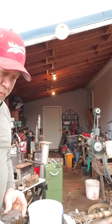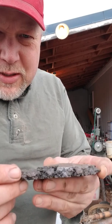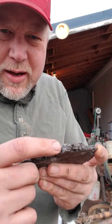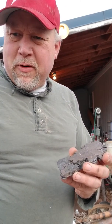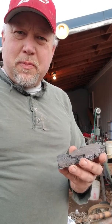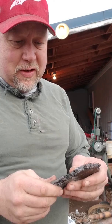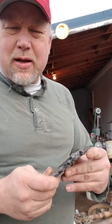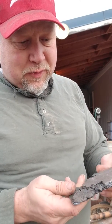Not too long ago I made a knife - this right here, you can see it on the edge - this is part of that bloomery steel I made where I did a bloomery right here in the yard. Set up a fairly large bloom furnace and kept adding charcoal and bits of horseshoes and old nails, mild steel. As it went down it picked up carbon and became this. I posted on my Instagram a knife that I made out of that - I probably should have folded it one or two more times, but I'll know now. It was structurally fine, a great knife.